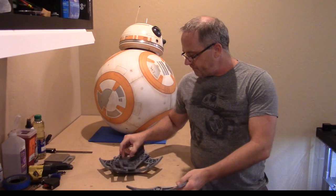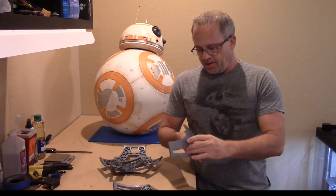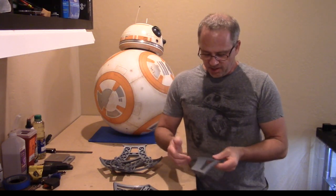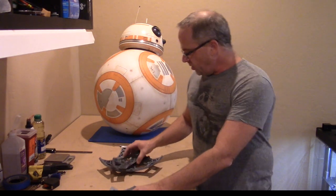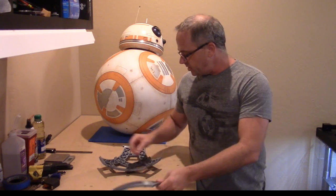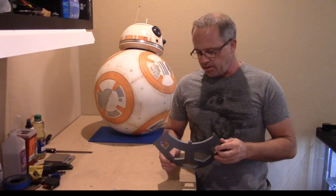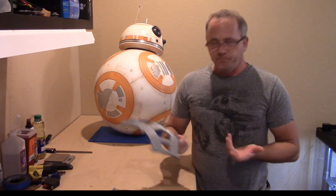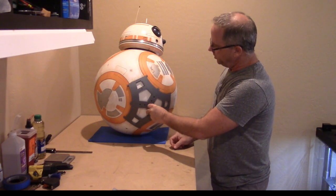Kept going farther and farther down the path, still working on that design, doing different things like removing ribs. This version had nuts that you'd drop into place for the piece that screwed on, very similar to the TNM sphere. But I didn't like having multiple pieces that needed to be bolted together either. So as I went more and more down the path - into the R20 range, revision number 20 - I'd gone from three little pieces to one large triangle piece. The beautiful thing about this design: you only have eight pieces that create the skeleton underneath.